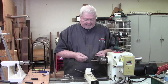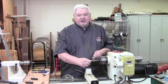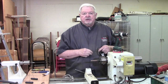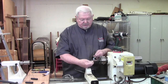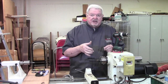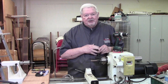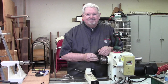I've got to add a postscript, and it's about safety. I said this earlier but I need to reinforce: if you take this wire, wrap it around your finger, and start making that cut, you're going to be like the pictures Dave found on the internet — the four-fingered woodturner. That will snap your finger off in no time at all. Never hold it like that — it can still grab your finger or pierce your skin. Without that handle, it's not a burning wire and it's not a lathe tool — it's just a piece of wire that can do damage. Be sure to put those handles on. If you don't believe me, go do a YouTube search on burning wire accidents. Be careful.